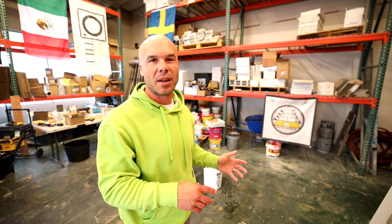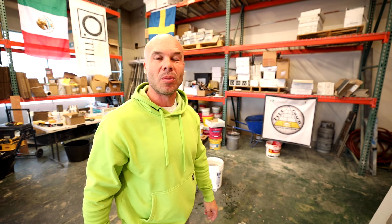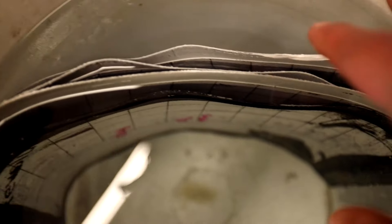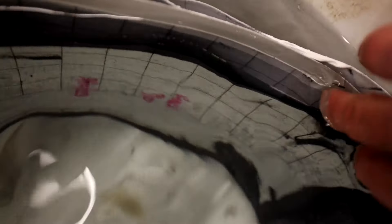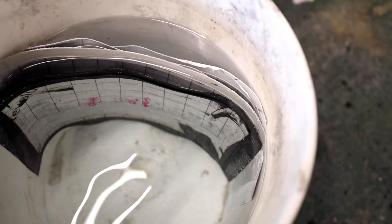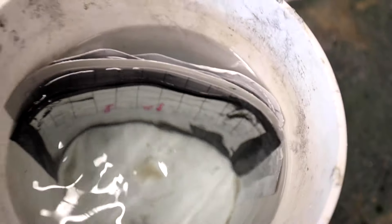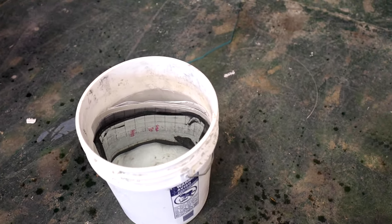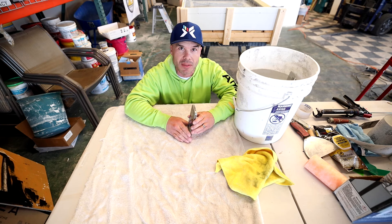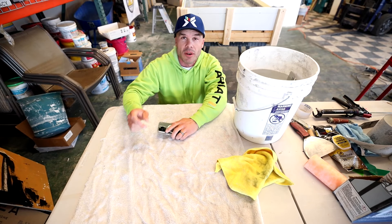It's hard to even get the extra off without it just gooping everywhere. I wanted to try the really low viscosity ones because I wanted it to apply like thinset, not be so hard like the KERDIFIX, but this is just too low — I don't think this would work. The nice thing about this private label company is they have all different viscosities, different cure rates, colors, and all the properties you would want. So I've got my four samples soaking in the bucket of water — the sealant was still wet as soon as I applied it when I put them in. Let's give them a week and see how they do.